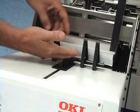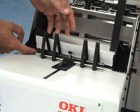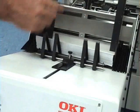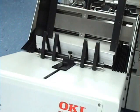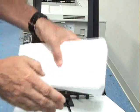Function of the wedge is to lift that product up off the deck so the belts aren't trying to pull that piece off the deck, and you're transferring a little bit of the stacked weight up against the pre-gate. Once you have your wedge set, you can go ahead and continue loading the product.